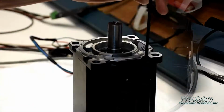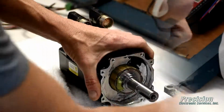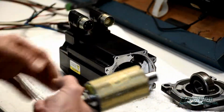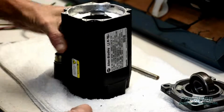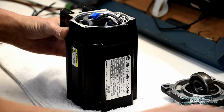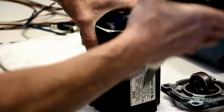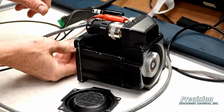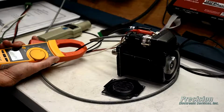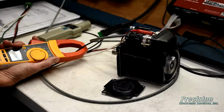The motor shaft, end bells, and magnets are carefully checked for damage, as are the housing, covers, connectors, and other mechanical components. All items found to be defective, damaged, or out of tolerance are replaced or repaired as necessary. When the motor is reassembled with new bearings and other parts, the feedback device is aligned per the manufacturer's specifications. The motor is then burned in during a run test and rechecked for proper alignment and feedback device accuracy.